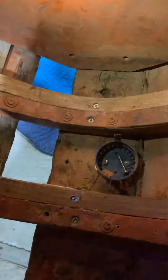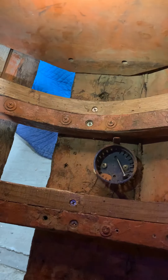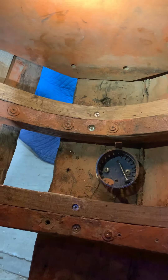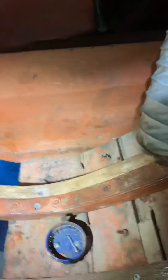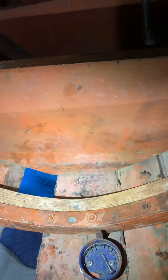The other thing we're going to do — you see these sawn frames right here — they do not seem to be bolted to the keel, so we're going to drill and bolt those to the keel. Anyhow, that's where some of your last advance went. Thank you.